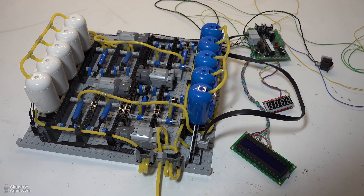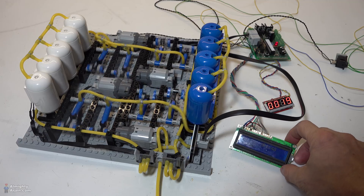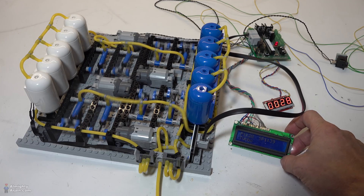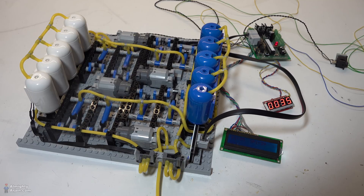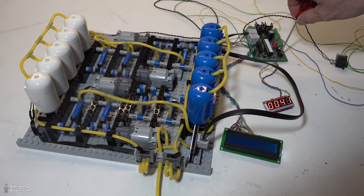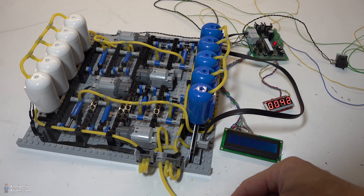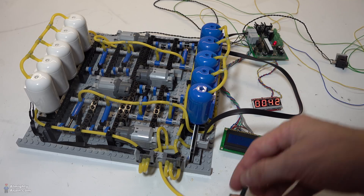Let's enable the thing and see what it does. So now it's in turbo mode and the display is saying 'turbo' — you can see the pressure rising. The set point is now set to 39 psi. This is a bit slow so I'm going to increase that a bit. You hear the difference? Now the turbo is off. Let me show you once more — we're going to remove some air until it's below 35 psi and then you'll hear the compressor running on 12 volts, and when it reaches above 35 you'll hear it run a bit slower.